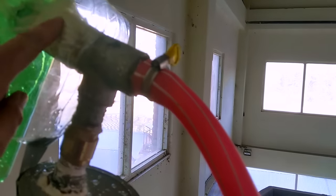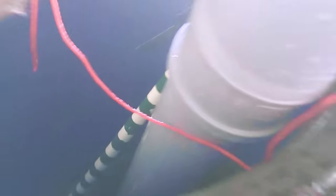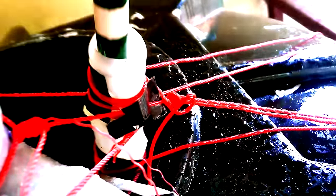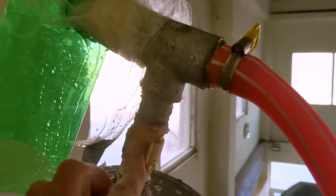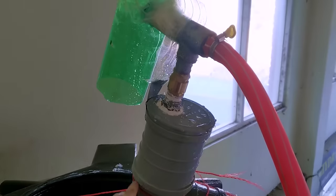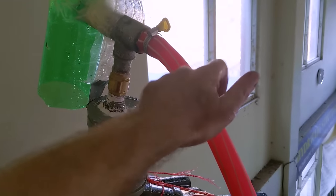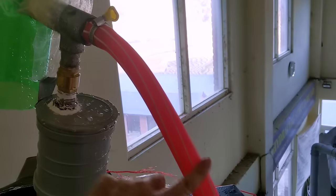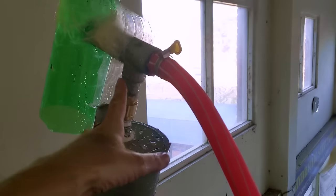So this is the top assembly. There's a valve so that the water can fill the tank, and then it's got a sketchy float valve — just a pipe, painted green and masking-taped, with a bit of polystyrene on the bottom. It does an alright job. And then another valve here, so the water comes out, fills the tank, then you turn the pump feed to this hose off, and the tap to the drain down on. The water weight — like three, four, or five meters — pulls back and sucks air out of this cavity here at the top of the whole system.